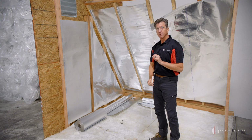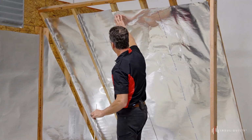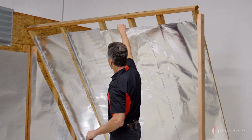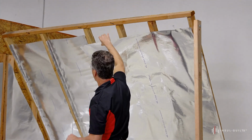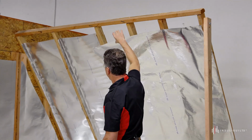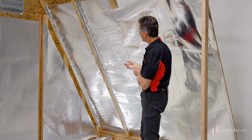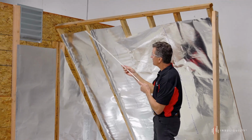So when you do have a radiant barrier and it's installed properly, what happens is the heat comes through from the roof, and the radiant heat then is trapped behind the radiant barrier, between the radiant barrier and the roof underlayment, and the heat travels from the base up this way as it heats, superheats, and the air then is vented out of the top of the space here.